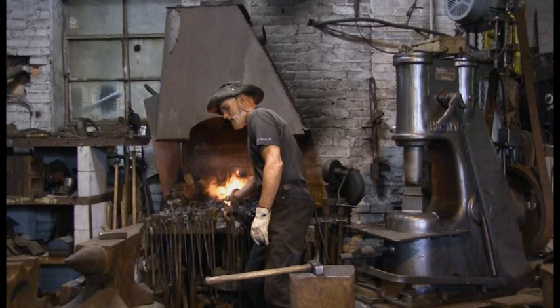I set this anvil up to work with an apprentice so that he wouldn't be afraid of damaging a really good anvil. It was actually a little high for me, which you'll see in this next sequence. Please notice the very long handle on this lightweight hammer — the hammer weighs about 2 pounds. This is a hammer I made about 35 years ago out of a truck axle. The long handle enables me to choke up on it or really get back on the very end of the handle and get a very high velocity blow. Because the anvil is too high — probably an inch and a half too high for me — I was unable to really get back on the handle like I like to.